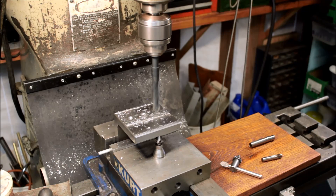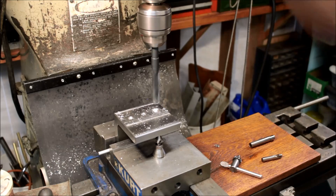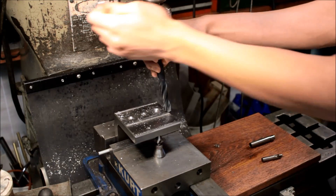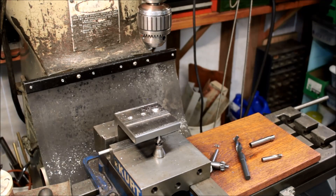They were a fresh brand-new, barely-ever-used drill bit — real sharp. They really didn't like drilling with no pilot hole, and I've had generally pretty good luck with these bigger drills with no pilot hole, but this one didn't want to go for some reason. So I went ahead and took it out, tossed a quarter-inch bit in, and put a pilot hole in all of them.